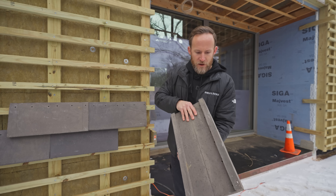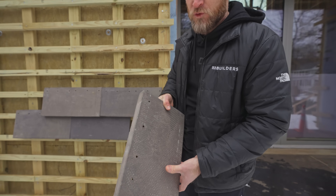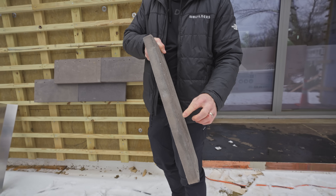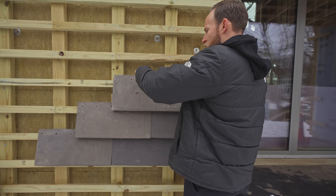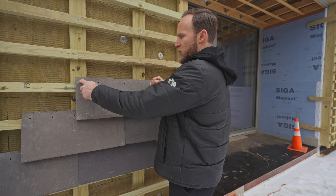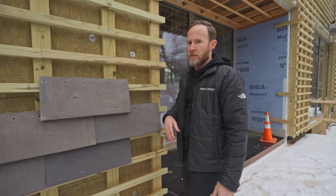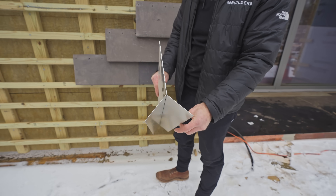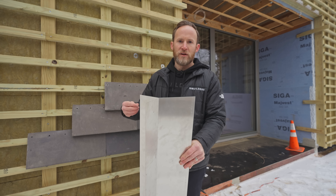In terms of the install for these shingles, they have pre-cast holes — so as you cut them, you're not drilling any holes. Those holes are actually drilled on an angle. You can see on the back they come down a bit, and what that does is as you hang these and install a screw, it goes down hitting the top edge and then hitting your strapping. It can be supported by gravity, but of course you want two points tying it back to the wall so it can't be peeled off. In a future episode we'll talk about our corner details — this is a first peek. This is a metal fin detail, actually a piece of aluminum right now, but the final product will be a stainless steel fin that will capture all of the corners, including the window returns.